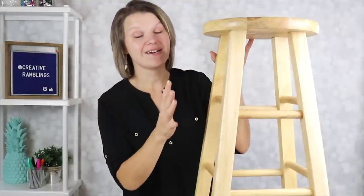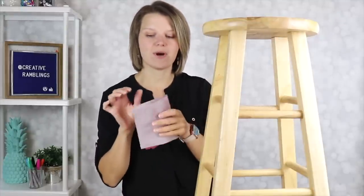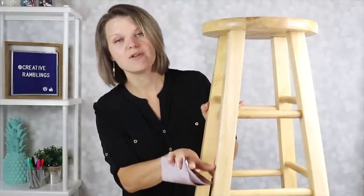Stools like this — you can really find a lot of these at thrift stores. You might even have one in your home right now, but this is just a 24-inch wood stool. If you do have to buy one new, they're pretty inexpensive. It has a nice shiny finish right now, so to decorate and dress it up we need to sand some of that off. I'm going to use 150-grit fine sandpaper to take off a little bit of this finish so the paint will stick really well.